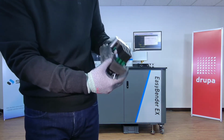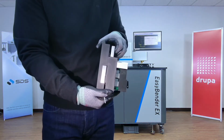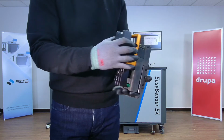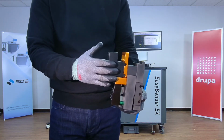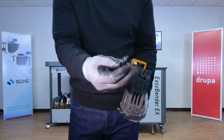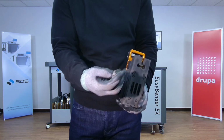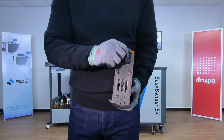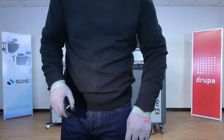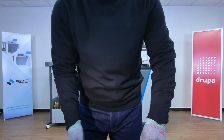Try to extend the life of the tool by turning it over or flipping it over to use the other side of the tool. So this is the nick tool, and I just want to go over perforation tools here again, and same concept here, but it's got the automatic bevel support driven by electric motors in the back of this tool, and it's pretty much the same here. It's got the same male tools that can be flipped over or turned over to extend the life of these tools. And same concept, and you've got three customized tools. This can be used for a custom perforation, cut crease rules, and our add-on crease pieces and something like that, that you could actually make those pieces out of these tools.